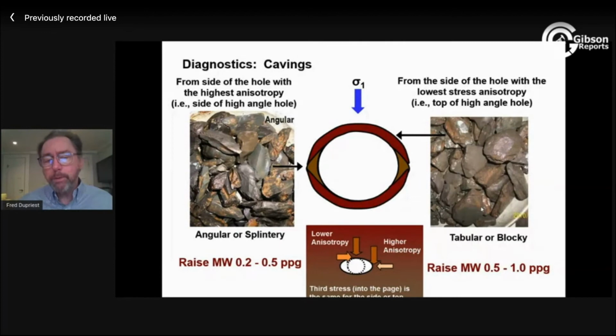Now, we can do models, we can do math, we can predict mud weights and all of that, but we do models as engineers to predict the likely outcome, not the real outcome. We model to create conditions that we think will work, but reality always trumps. And for whatever limited redesign process we design, you should always invent a field process for seeing whether or not it's working. And in this case, it's simply watch your shakers. No matter what your model said on stability, watch your shakers.